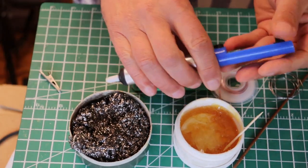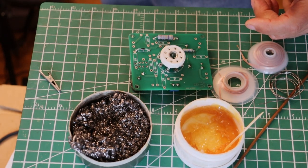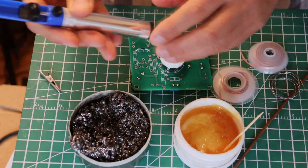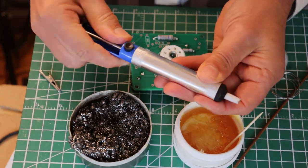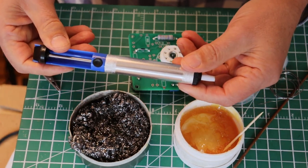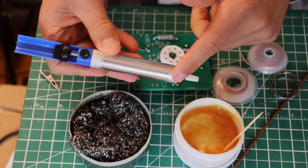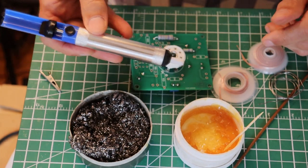You've got to keep these pumps clean. The first thing you do is hold it over the garbage can and drop the plunger back down - that will drop things out. All pumps, whether electric or manual, need to be kept clean. Open them up after a round of deep desoldering. If you've done a lot of desoldering, keep the pump completely clean. Work carefully, use gloves, do this outside over a garbage can.